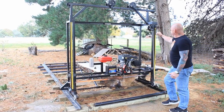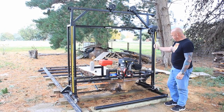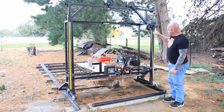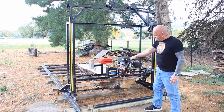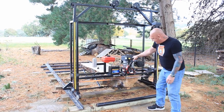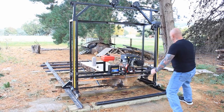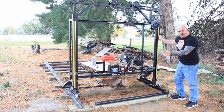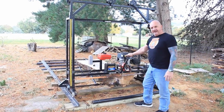Now I've got another adjustment knob here which is attached to some thick sailing yacht rope, and this is what drives the whole mill forward on these rollers. This handle pulls it and you can guide it — otherwise you're trying to push it from one corner and you'll tilt the whole mill, so it doesn't work. If you're thinking of making one, make sure you've got this handle.